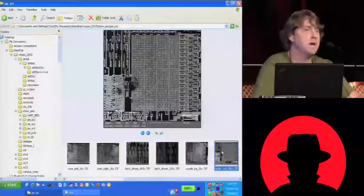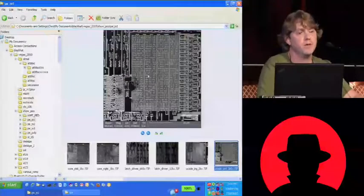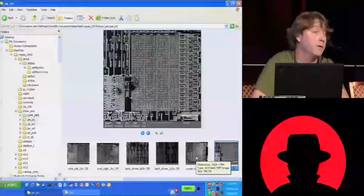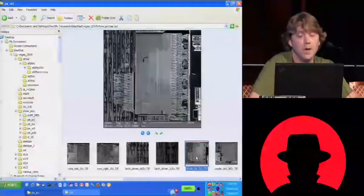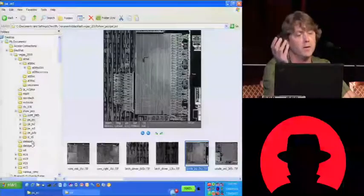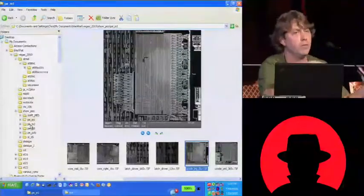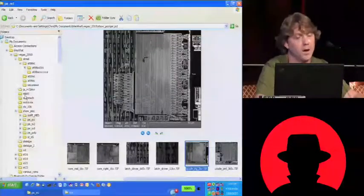Here, if they had made microcode changes to the 66 PE, I would have seen it in this table. This is one of the instruction tables. The 66 PE, as I've discussed when I did the TPM attack, runs on microcode. And so it's kind of their doom. Now the bus scrambling I spoke about earlier, nobody's doing that anymore. They're doing it maybe outside the core, but in the actual central nervous system of the chip, the CPU is almost never scrambled, and I don't know why.